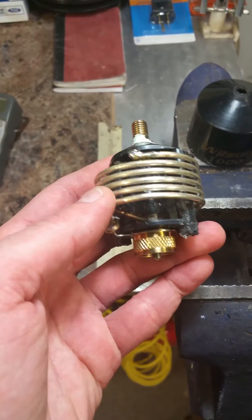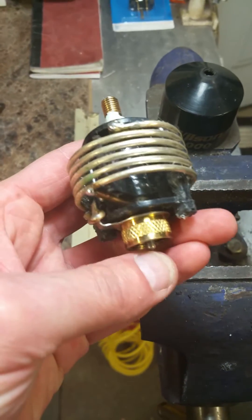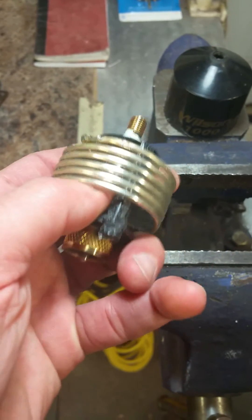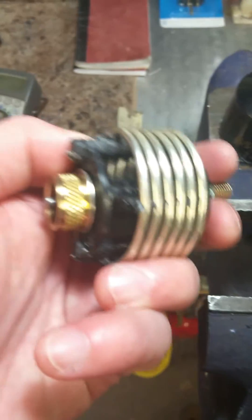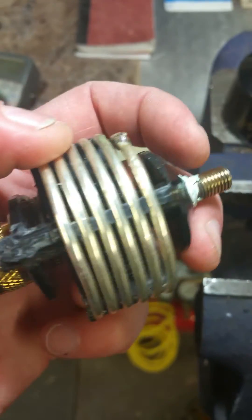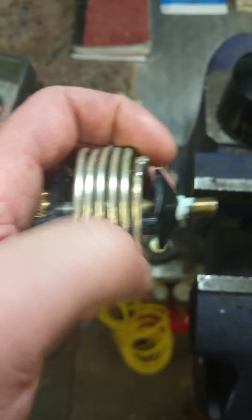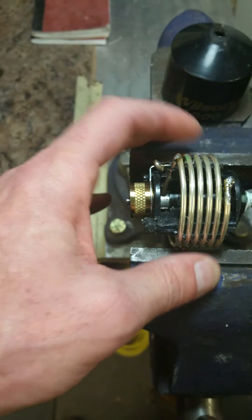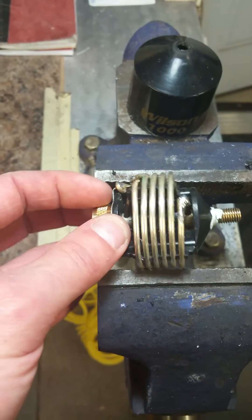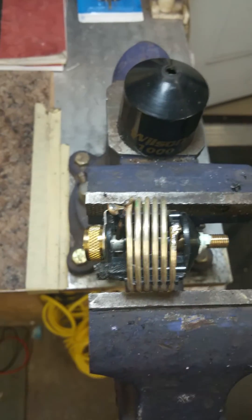Just a quick look at what's inside the antenna. I might do another video where I desolder this and check the connection from here to here. If it's open, that would lead me to believe this piece isn't solid — it's probably a two-piece inside the plastic covering. That would make sense because you'd work off your load; otherwise you'd just be bypassing it. So it probably is two separate pieces.